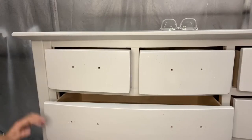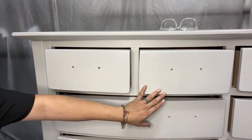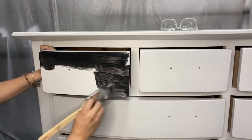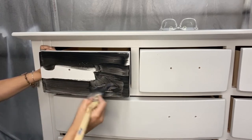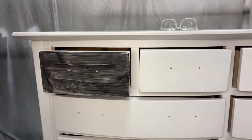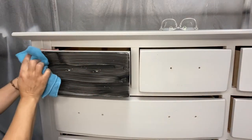Let's get right into the video. The first thing we're going to do is apply it on one drawer and then move on to the drawers individually. I'll do the top two and then do a time lapse of the remaining ones. I begin by applying a very thick layer of glaze on the drawer front, specifically getting into all of the nooks and crannies. This dresser was manufactured to have some imperfections — little holes and details — and those are coming in very handy because we want as much glaze in those as possible; it just gives it even more character.